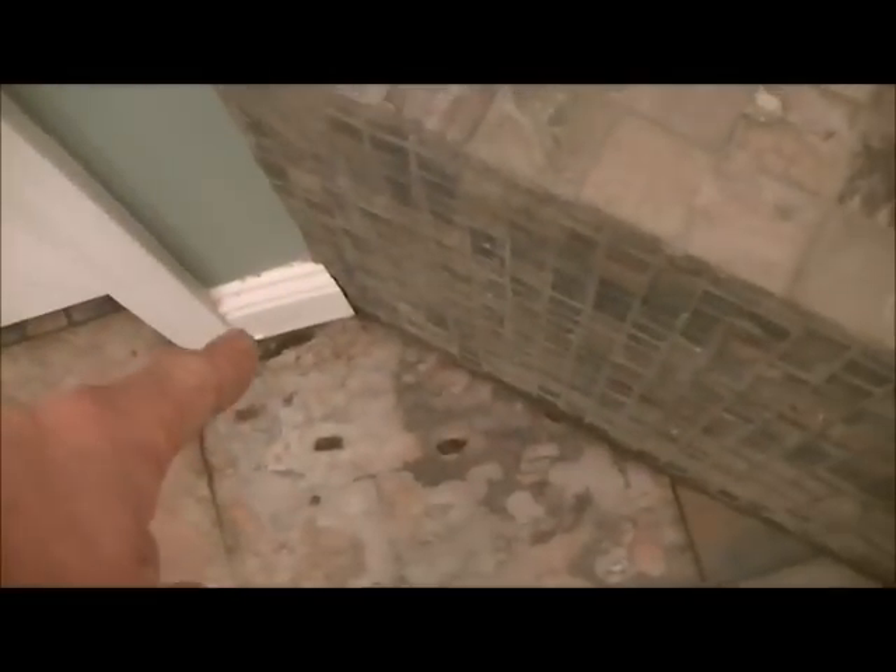The tub had a very small lip — maybe about 4 inches — and what I like to do is make things symmetrical. The lip stopped about here before, so I brought it all the way out to the edge of this corner wall, which goes all the way down to that baseboard down there. There's no reason not to have a larger surface area on this. They used the 2x2 on top — that's what she wanted — and then on the face of it, 1x1, and all this is slate. It's very, very busy with a lot of grout lines and a lot of porosity, so all this has to be sealed as well, including the top.